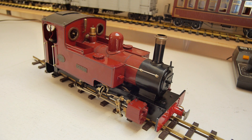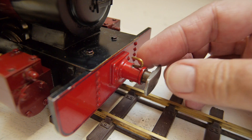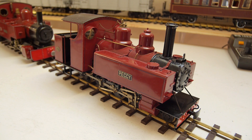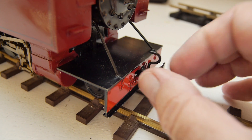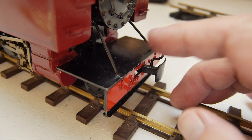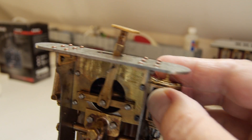This is the first steam loco I made, based on a Roundhouse Lady Anne. The buffers were sprung white metal castings made by a company called Gratec, and I don't think they make them anymore. The second engine I made was Peggy by Wrightscale. The buffers I made for her swing from side to side but are solid, so when a coach or wagon hits them it makes rather a loud clatter and they're a bit unforgiving. My next designer buffer I made for Blanche, a DJB Engineering loco. They're spring-loaded, they swivel about a pivot, and work quite well.